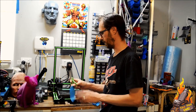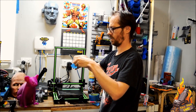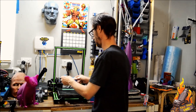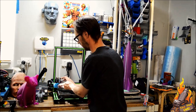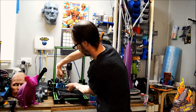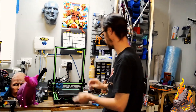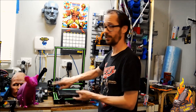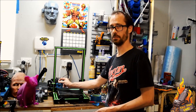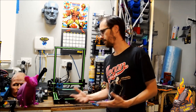So a quick way to fix the cooling problem — I myself just got a bit of blue tape, cut a hole in it, and put it right over the hot end. That's a quick fix, and that's how long it takes to fix that. The problem is, you fix one problem but you create another problem. By blocking off the airflow here, you also let this hot end not cool down very well, which causes clogs and swells your filament. So it's a catch-22.